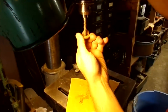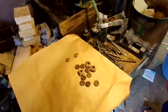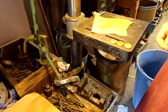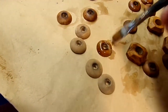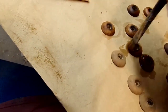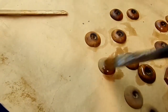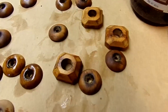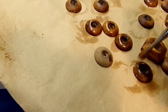The screws come out looking much better after spinning on the drill press. You can compare — looks much better. On the bottom of the board, no one ever sees those, but it's nice to know they look like that. Here are the buttons getting a quick coat of shellac. I'll probably give them another coat in a few minutes — the first coat usually gets sucked up by the wood and they look kind of dry. One more coat and they'll look a little shinier, fuller. Original buttons, got the square ones too — those look nice. I gave those some sanding.